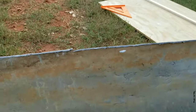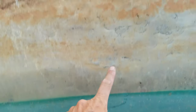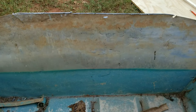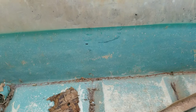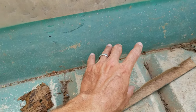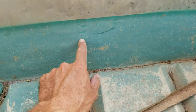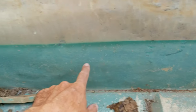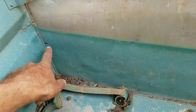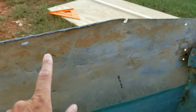I've determined that the original wood in here from top to the paint line was 10 inches. I'm going to give myself 11 inches to account for drilling through a hole for my live well fill, giving myself some extra room. I marked 11 inches from the bottom and leveled over to find my two side points, since I can't measure from the top.